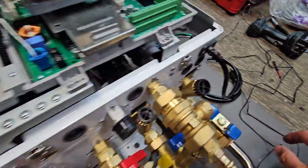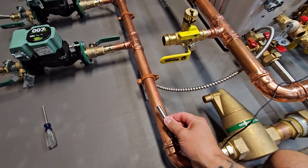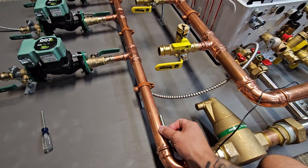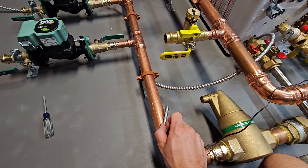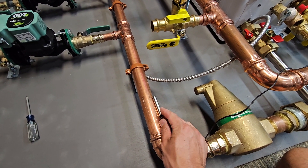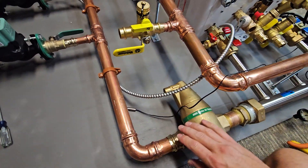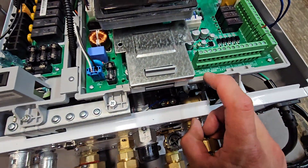Once those are tied in, I'm going to install the system sensor, which is right over here. This sensor tells the boiler what the actual temperature is in the secondary piping going out to the heat emitter. We strap it onto the supply feed right here, zip-tie it on, and then I always wrap it with self-sealing silicone tape to give it an insulating factor and additional adhesion to the pipe. The zip ties alone work well — the heat will radiate right into the sensor. I like to tuck the wiring down behind here and attach it right to these wires, feeding in to the supply temperature sensor connection, which has two little pins for it.